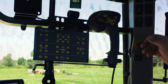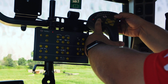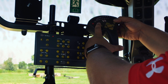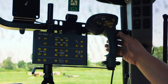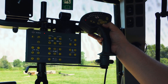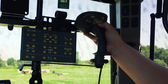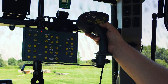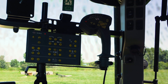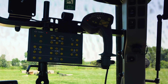So we always want to bring in the boom while it's level. The last step: once we're in, we raise our tilts on our boom sections. Once our tilts are all the way up, we then lower the booms into the cradle. To cover that again: keep the boom level, fold into transport, then raise your tilts and lower into the cradle.